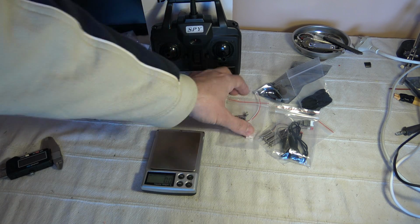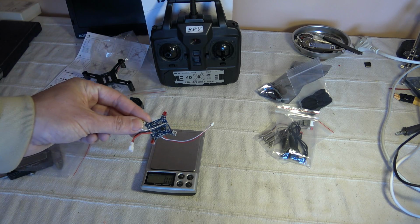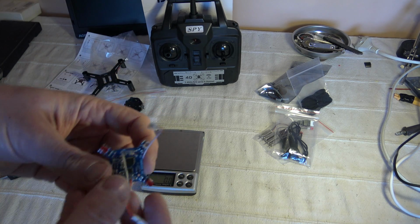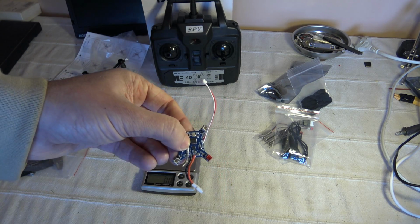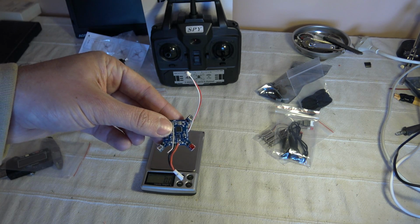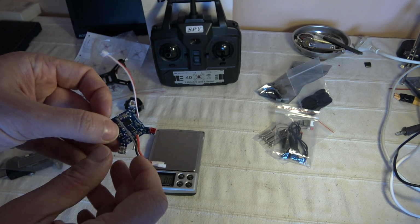So we have the flight controller board, and as I said in my introduction, this one won't support any acro flight. It's a basic one with at least some motor connectors. That's great, the 2.4 GHz. And here we have the main central MCU, which is a Panchip model, including the ARM core and the RF module. So everything is integrated in 2-in-1, ARM core plus the RF chip. And the bottom black square is the 6-axis stabilization model.